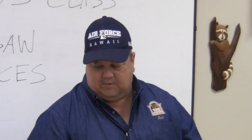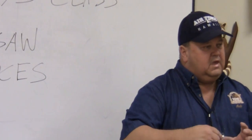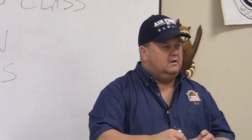Now, the book doesn't do that. The book does the flocking, and you sand and get all ready. The book does the flocking, and then you tape. They have you tape the drawer before you put the shellac on. Then they have you take that tape off, put the flocking on with new tape, and then you get all done with that. And then they want you to tape the whole top of the thing off, and then do your coating after flocking's done.